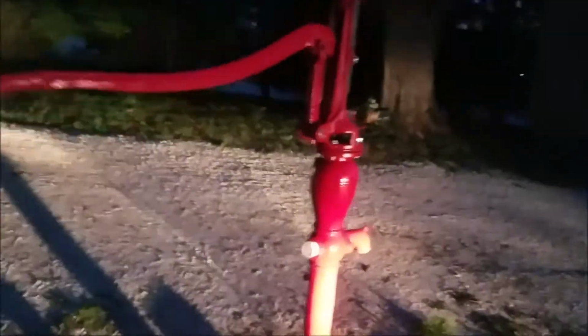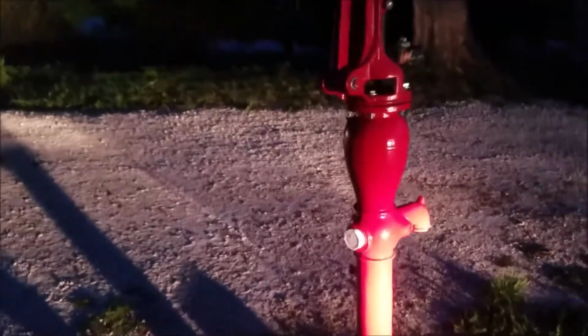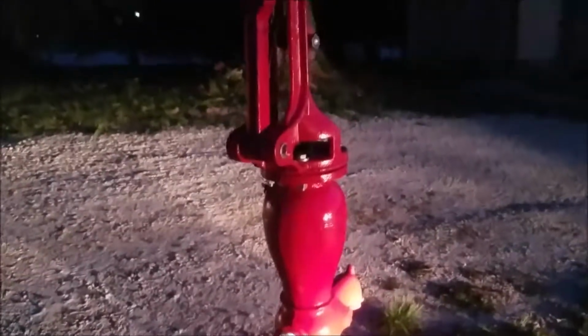So now when I pump the last pump, water's out, I let go, the handle comes up because there's 50 feet of water in that pipe. And it's pulling that piston down. So the drain hole would help me a little bit, but I'm still gonna have this problem. So I'm not sure if that's normal. If anybody has any ideas, leave a note down in the comments.